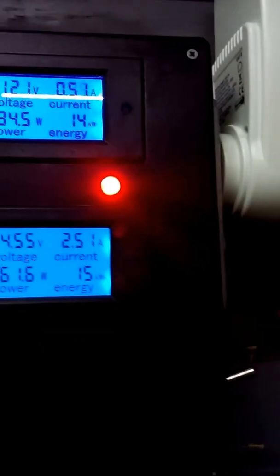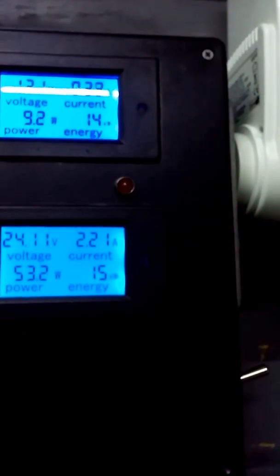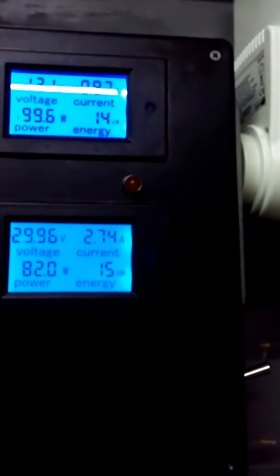So this is all hardwired, and it's controlled by a wind switch. The wind switch switches at 10 miles an hour and it does have a delay in it. The winds are crazy right now, so the electronics can't always keep up exactly with the winds. Wind can go from 20 to 50 miles an hour in three seconds, so it's tough for these meters to keep up.